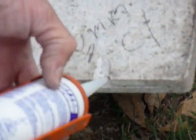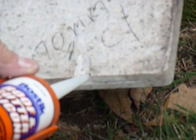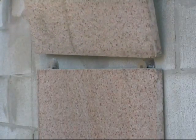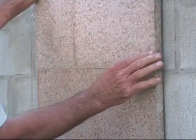It is best practice when installing stone clip to secure the panels at top dead center through their fixing point and have a 2 millimeter clearance under the shaft, so the weight that is being transmitted downward is not going to impact on the top of the panel below and will only be carrying its own weight. This is the true meaning of mechanical fixing.